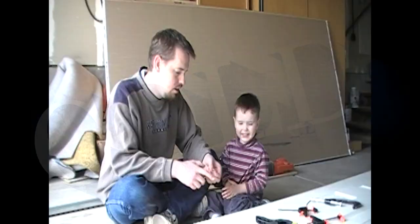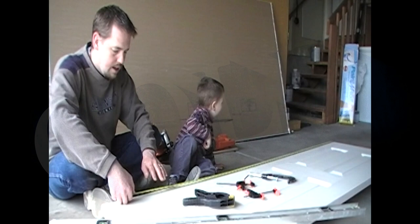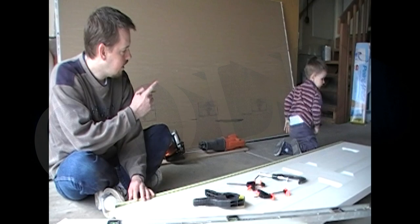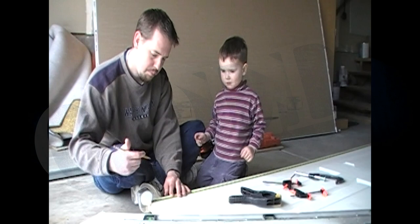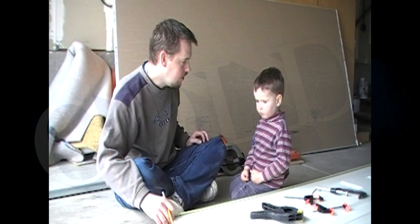Let's go out and cut them. We're going to put this down here — see how I catch it on the end? It's caught. And we're actually going to catch it right up close to the edge so it's parallel. We're going to use a pencil instead of a pen, because this is a finished product and we're going to have to paint it later. That's how the straight edge of our saw works — it's one inch. Some saws are different; you have to know the width of your saw so that way we have a nice straight cut.